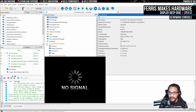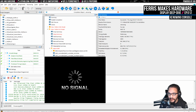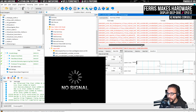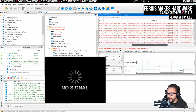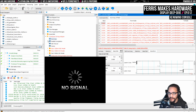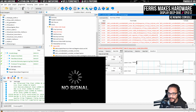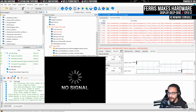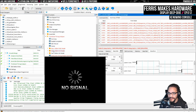Doesn't seem to be. The other thing that happens with this a lot is we actually have timing violations in the report here. And it really annoys me because it's always with these parts. It says CPU here, but this is the CPU inside the memory sequencer, which is really annoying to me that I have this generated memory IP that doesn't meet timing on this device. It really bugs me. But usually these slack numbers are not that bad, and these are worst case timing analyses anyway, so this typically works. But yeah.